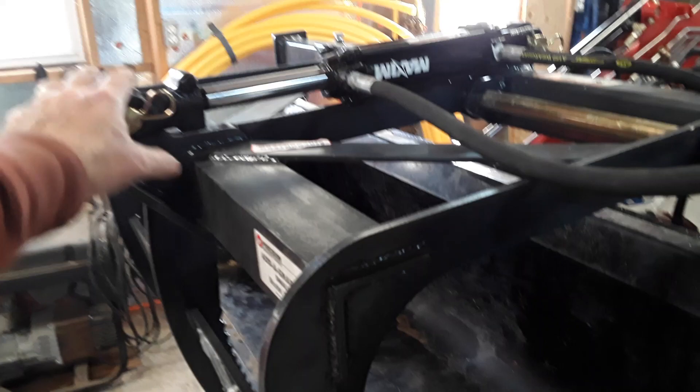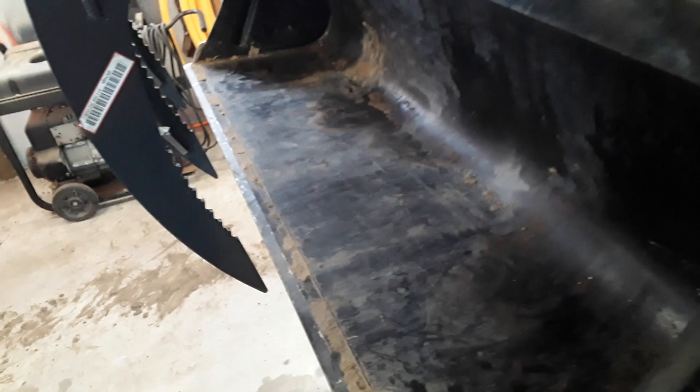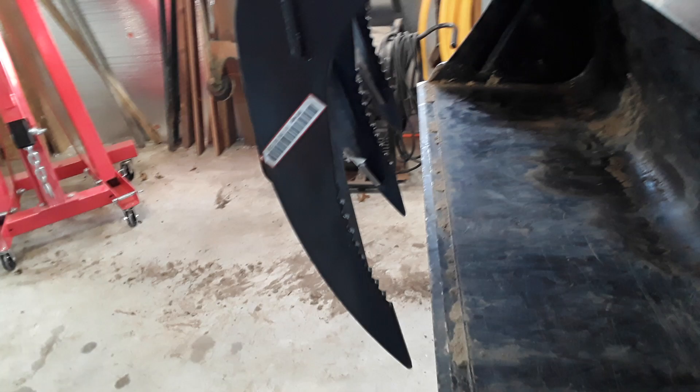I don't really think it's necessary. One mistake I made — and I'll make you aware of it. I got this all set up, had the grapple hanging from my shop crane. The instructions say to have this an inch inside here. I had my first hole in and was ready to go, then I took a break for lunch. When I came back and started drilling holes, it was only after a couple were in that I realized the bucket had drifted down while I was at lunch — not surprising, they typically do that. That ended up moving the ends of my forks outward. This is fully closed, and I don't think it's going to be an issue for my purposes, although if you had some small thing you were trying to retain it could fall through. If it ends up being an issue, probably the best solution is to look for a cylinder with just a little more stroke.